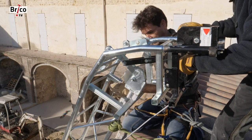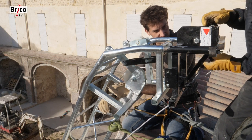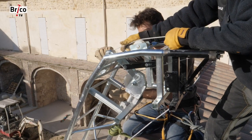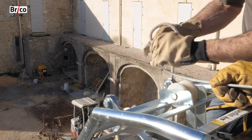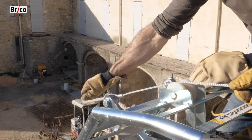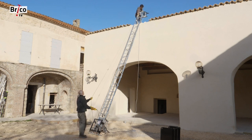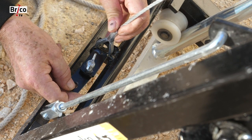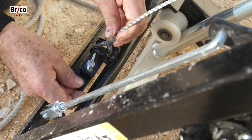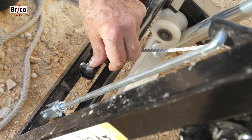The cable passes over the upward pulleys and then on the down pulleys. This is the trolley's traction cable. Here we'll attach a rope and pull the cable all the way down. I'm lowering the cable all the way down. Now I'm going to secure the cable to the bottom of the trolley using this slot and this pin — the pin is threaded through the cradle and onto the cable, and I screw it all together. The machine will soon be up and running.